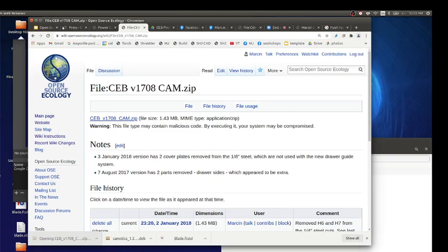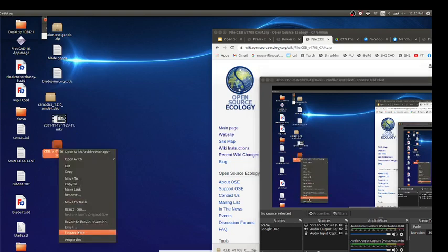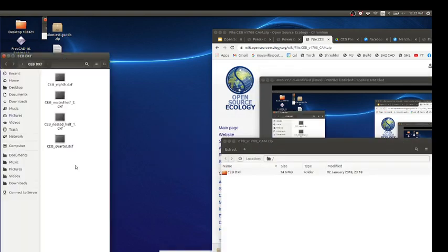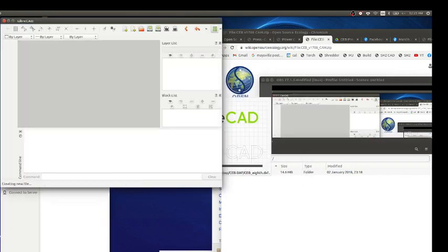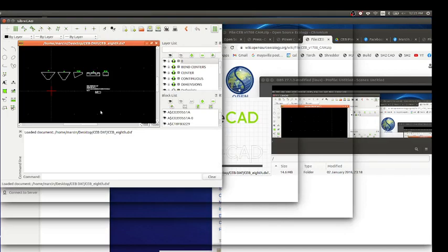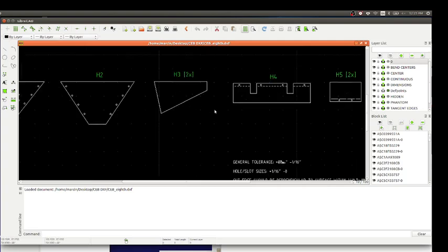The hopper, for example, is eighth inch steel. Some parts are a quarter, like the hopper seat. Most of it is half inch, which is the structure. You need that. But what are the DXF files looking like? They look like DXF files. If you double click on it, what happens? You open it up in LibreCAD, which comes stock with OSE Linux. Then you'll see this is something you can actually give to a fabricator. Here you go, here's the hopper parts. Cut it out for me, please. And they do that. So we've got digital fabrication capacity here.